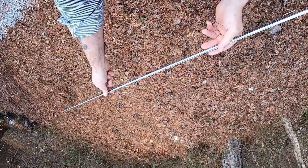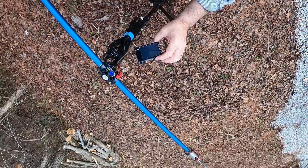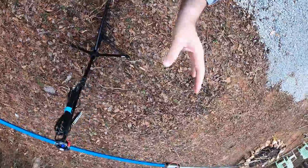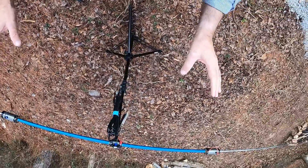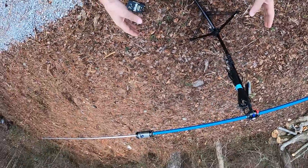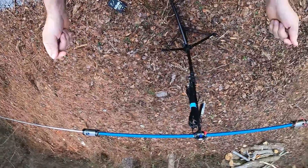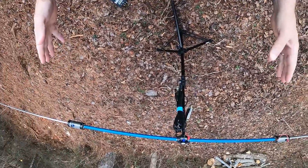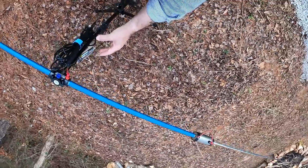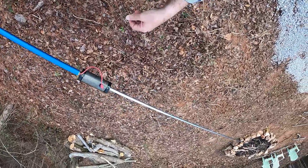I'm down to 2.5 to 1 — that's enough for antenna tuners. Okay, I got it down to 2.16 to 1. If I fool with this some more I can get it down — I played with this a little bit in the house and got it down to like 1.4 to 1. It's just a matter of tweaking. I may have to adjust the windings a little bit.